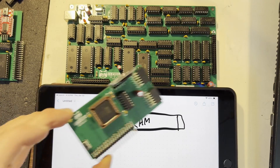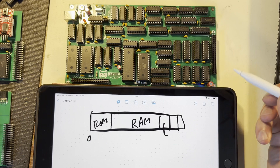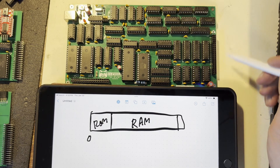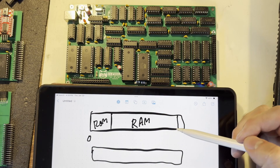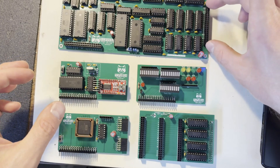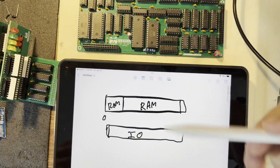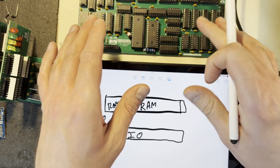For external I/O, like I/O cards — with for example the 6502, there would be a chunk of memory reserved for the memory mapped addresses — but for this computer, there are two separate control lines coming off of the EEPROM logic. These two control lines are used to assert the read or write operations on the external device. So effectively, the external devices exist in a completely separate address space from the main memory. This is nice because it allows the I/O cards to take advantage of the entire 16-bit address bus, and it means there is no additional circuitry needed for address decoding. All the address decoding can be done on the individual cards, which helps maximize the amount of RAM available and also decreases the amount of supplementary circuitry on the board.